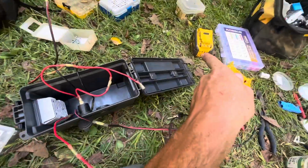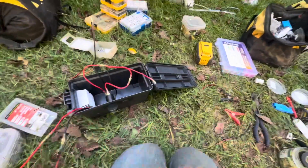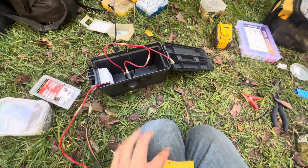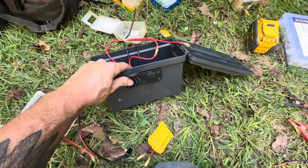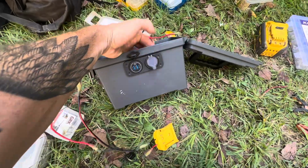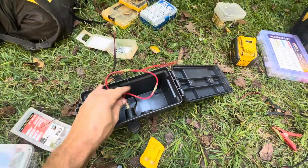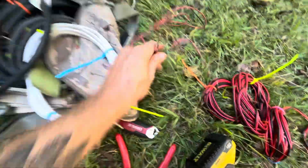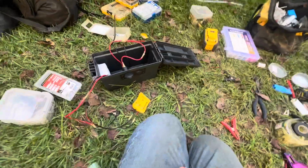So once you plug in your battery, it's going to route through this and step it down to 12 volts, because what's coming out of these things is not 12 volts, it's higher than that. And you can fry these sensitive little pieces of equipment that require 12 volts. So it comes out of this, and then I've split the power off, and I've run some of it through a USB port, and I have this open hole here, and I'm going to be able to run just plain female connectors outside, and I'm going to have a couple sets of different alligator clamps, as well as these smaller ones that I use when I'm testing electrical components. And I'll just be able to keep it all in this box. Be much more organized.